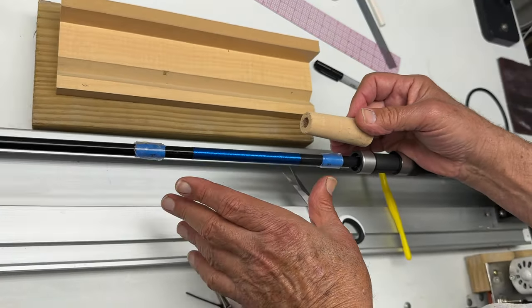And we're going to check it just to make sure that I'm seeing correctly, but I can tell just by eye already I'm not big enough. But this is one of those things you measure a couple times. See, it's not nearly deep enough. All right, so you see how that goes to there? So now I'm going to put glue from here down to here, and the glue will act as a lubricant for that to slide on there. So that's now the right diameter.